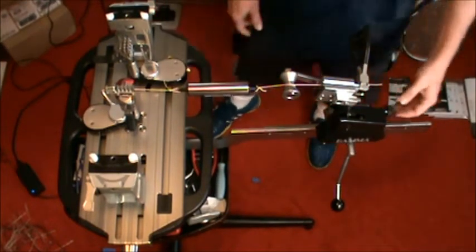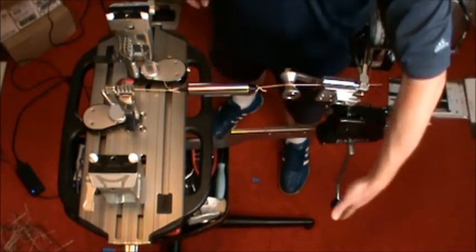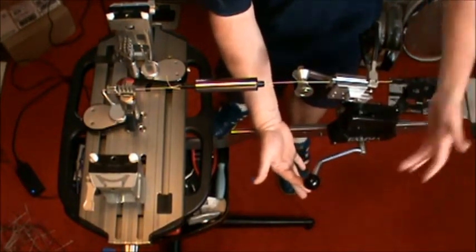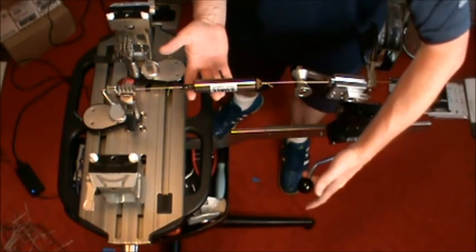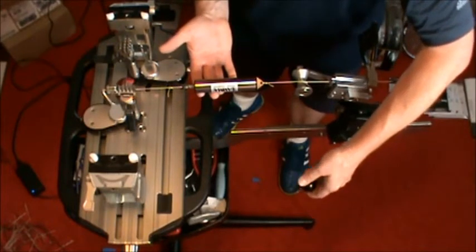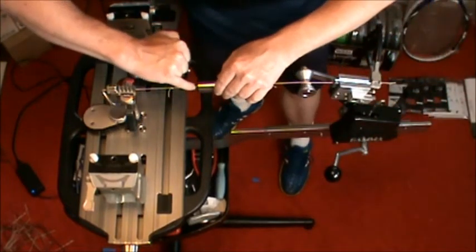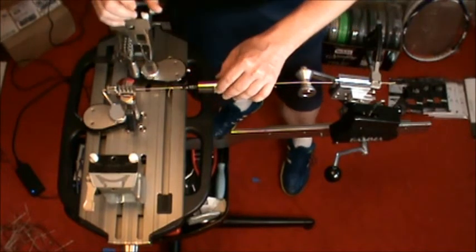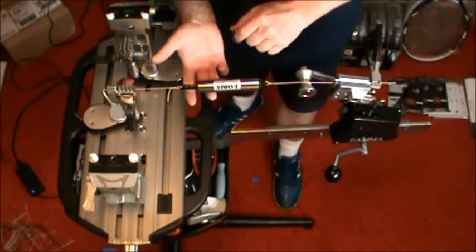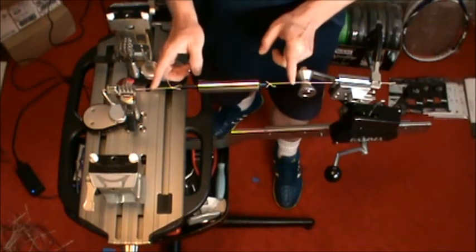And so now when I pull tension, let's say I have this set at, I think right now I have it set at 40 pounds. So when you crank, notice that the brake hasn't popped yet. As I'm pulling this up, that's when I want to be looking here at the side that shows the pounds, and my eyes need to be here as the handle reaches lockout. And so right there, I can barely see the white line that is where the 40 mark is. Because the longer I wait, if I wait right now long enough, I won't be able to see that white line, because this is going to slowly recede inside of the calibrator as these strings relax.